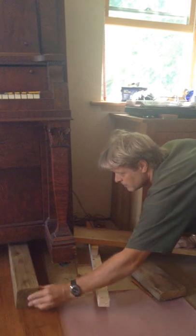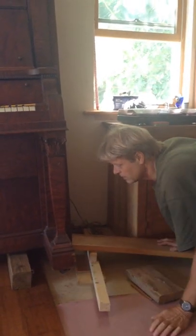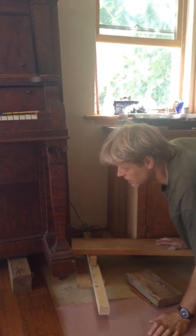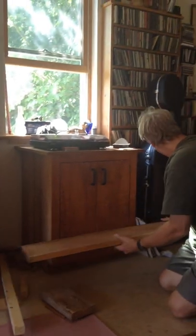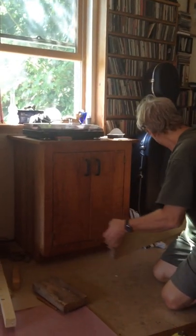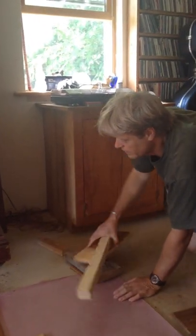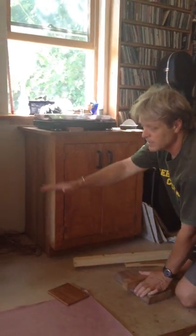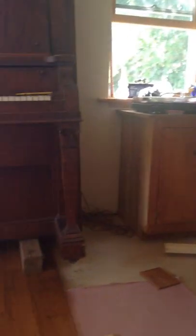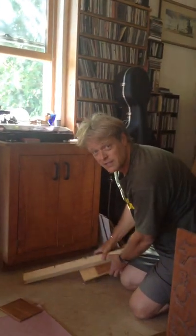Slide it under the piano over here so I can lay the new floor here. I'll lower it back down. When it was resting on the 4x4 I removed the fulcrum and the lever and lay the new floor here. When the floor is in place I'll do it again and lower it down onto the new floor. Easy way to lift half a ton with my fingertips.